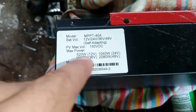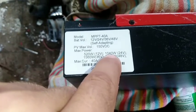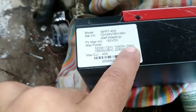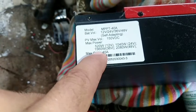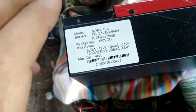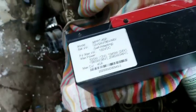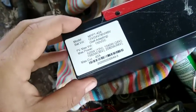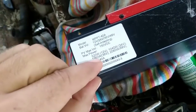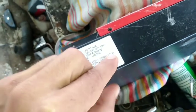Don't go above 1040 watts — I've found you can go over the number they state, but as soon as you go over 1040 it'll step up to 24 volt. So you want to stay under 1040 if you want a 12 volt circuit. I'm doing a 24 volt circuit, so I want to stick under 1560 watts. With eight panels at 190 watts, we're at 1520 — just under the 1560 mark. Any more panels and it'll step up to 36 volts, which we don't want.